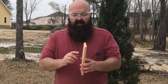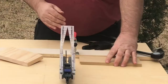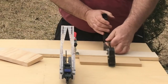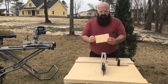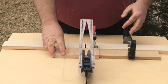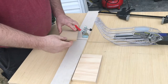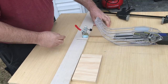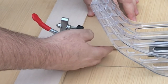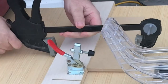I've made a stop block that has a chamfered end to collect dust so that sawdust will not get in the way of the cut. I'm going to lock it down right here. My piece will slide in and we'll make the first cut. The stop block has the chamfer cut in — if dust were to collect there it would just go into the chamfer and not get in the way.